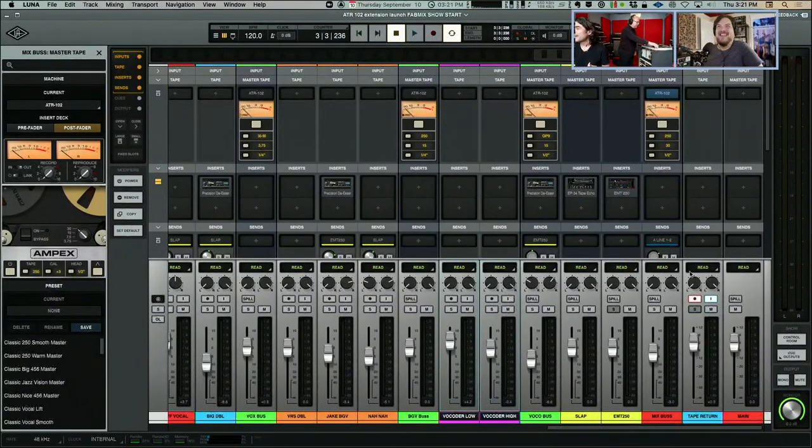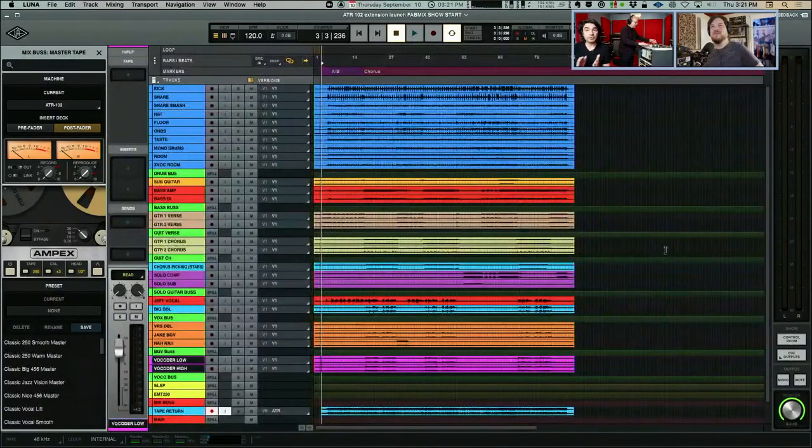Exactly. If you know the concept of input monitoring, which is a concept taken from tape machines, input monitoring is when you listen to what's coming into the track, not what's on the tape. There was latency in tape machines, by the way. The latency was that it takes time for the tape to go through the record head and then to the playback head, and that gap makes a delay. That's the original latency, and you can't change that; no moving the heads around. So if you're on input, meaning you're listening before the tape, there's no latency because you're listening to just electronics, not magnetics.